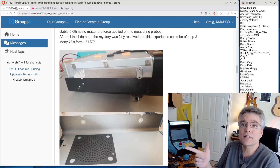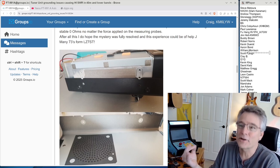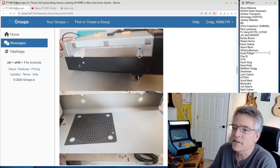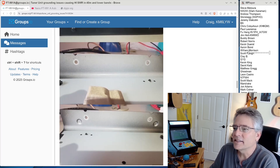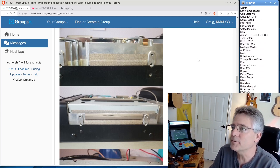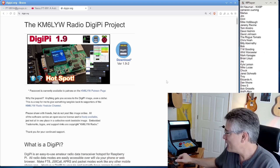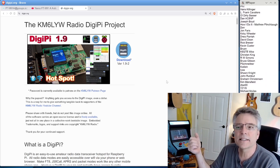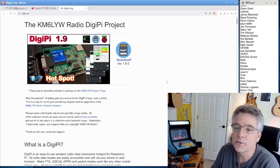We're back in the shack. I want to give a shout-out to Lima Zulu 7 Sierra Tango — he fixed this, he's the one that figured all of this out. It was a collaboration of a lot of people, really a product of frustration. His Yaesu actually has some extra bonding material, so it's probably a newer model than mine. He noticed the overspray on the case, which was ultimately the fix, and he's got all that sanded with lots of good bonding. So if you've got a Yaesu 991, the best thing you can get for it once your antenna tuner works is the DigiPi SD card image. Take a Raspberry Pi, get the SD card image, put it in — hook it up to your radio and it gives you access to all of the data modes we talk about on this channel, accessible via your web browser, tablet, or any Wi-Fi device. It works great with the Yaesu 991.